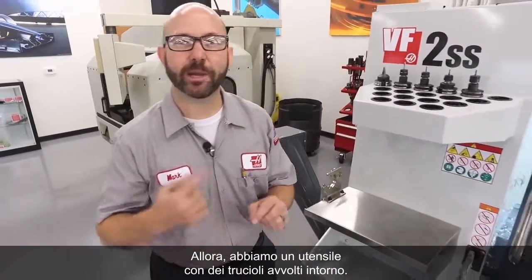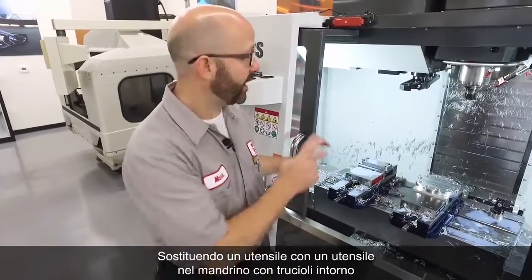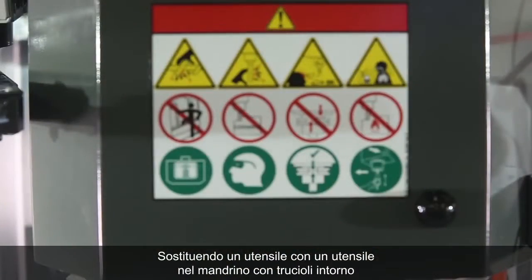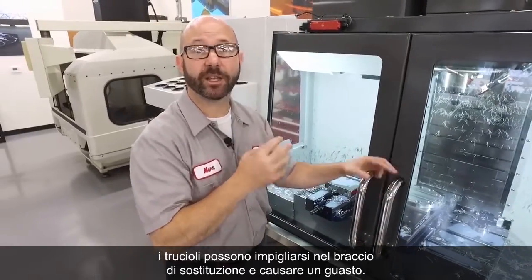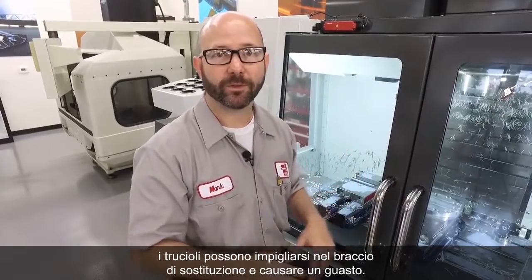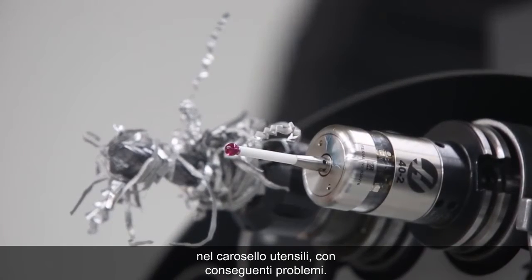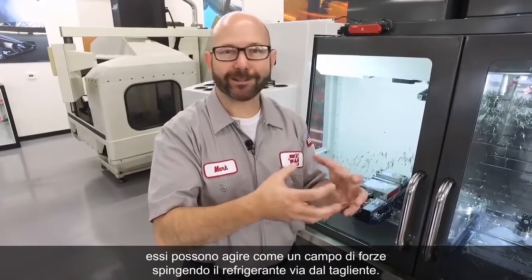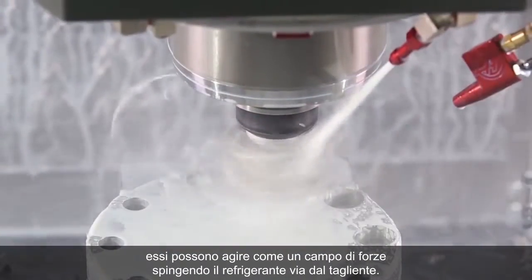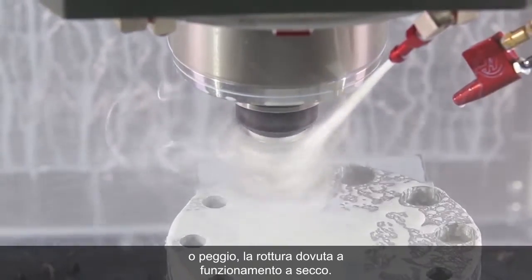So we've got a tool that's got chips wrapped around it. How big of a deal can that be? Well, it can be awful. If we do a tool change with a tool in the spindle that's got chips wrapped around it, those chips could get caught up in the tool change arm and cause a fault. Worse than that, if those chips catch a hold of my probe in the tool carousel, we could have problems with that as well. Also, if we have a big ball of chips wrapped around our tool, those act like a force field, keeping all the coolant away from our cutting edge. Our tool's gonna wear out prematurely, or worse than that, it could break because it's running dry.